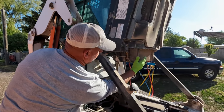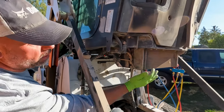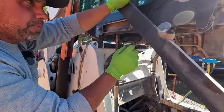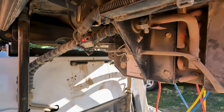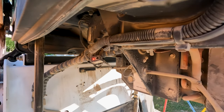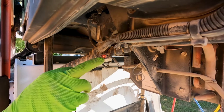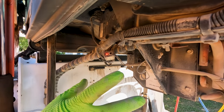Now that we're inside, we can see our evaporator core is on the front and our heater core is in the center. Now, when I say this is an independent system, the AC does not talk to any of the Bobcat controllers. If something goes wrong with your AC, you're not going to get any codes — the machine's not going to tell you what the problem is. So right here we've got an ATM — this is an automatic thermostat module. This module is the brains of this AC system.